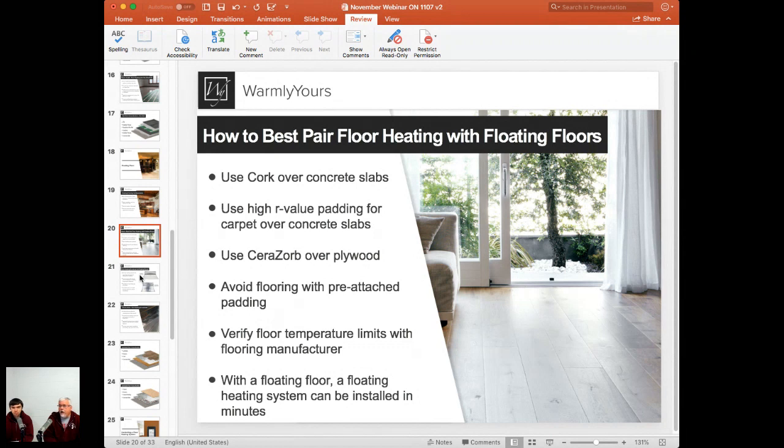With hot water, it's all BTU calculations based on the temperature of the air in the room. So I can say a lion's share of those systems don't even include a floor sensor, so they have no idea what the temperature of the floor is. When hot water tubes run into a particular room where all the tubes run together through the doorway and then spread around into the room, that doorway is going to be a much higher temperature than the other end of the room.